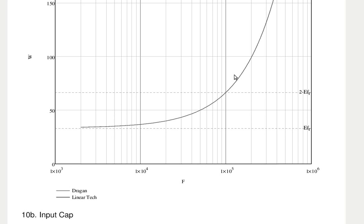I see. Conduction, meaning the magnetic field is turning into heat. Yeah. So the ideal characteristics are non-conductive and what else? A very good magnetic material. You want it to have what's called a very thin hysteresis loop. As the magnetic field swings back and forth, you want it to have minimum area under the curve.